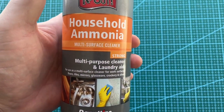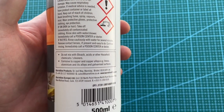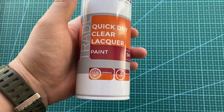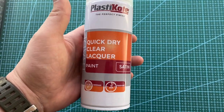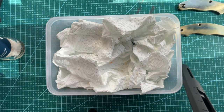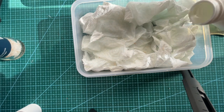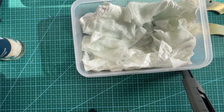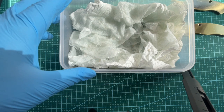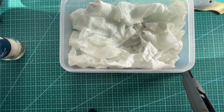It doesn't matter anyway because it'll be covered up with the shipwreck patina. So the products we're going to be using today is household ammonia — I got this from Amazon for about £8. I'll leave a link in the description of where I got everything. I've got some rock salt here but I think you can use any salt. I'm going to be using the Plasti Coat Clear Lacquer — about £8 from Tool Station. If you're doing it indoors make sure you've got doors and windows open because this stinks. Just giving it a nice liberal serving of salt, then put your scales in, put the lid on and leave it for a couple of hours.